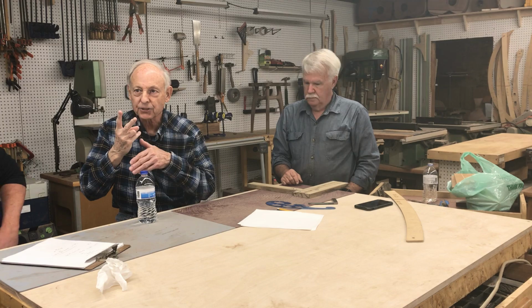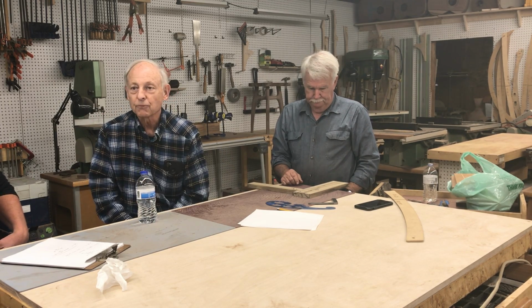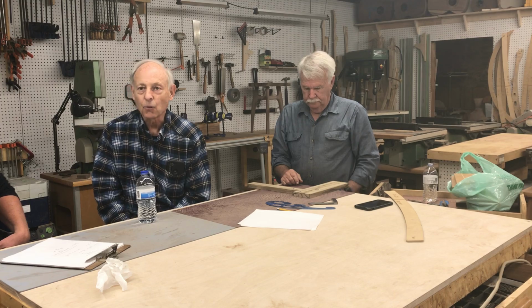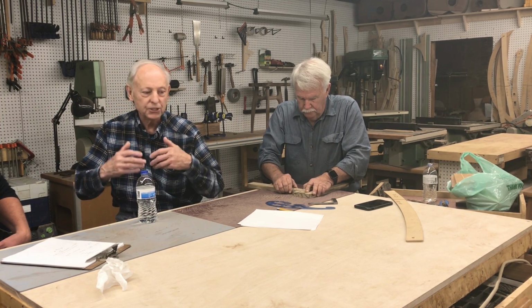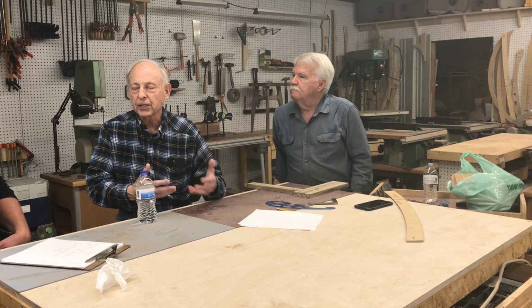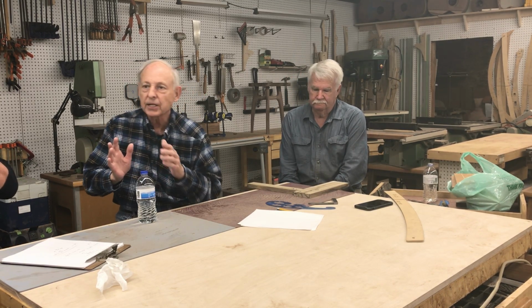And you only use two radiuses, technically with the French curve, an 84 and a 90-inch radius, like an inside and an outside radius, and they're only technically one curve, one side, the other side. So it wasn't like he mixed and matched a whole bunch, but part of it's just what you think looks good. If you want a little bit more of an arc, use a 78-inch radius. You know what I mean? Just play around with it.